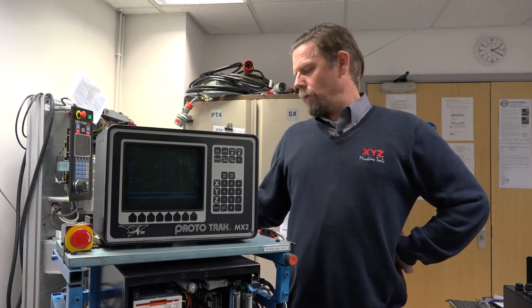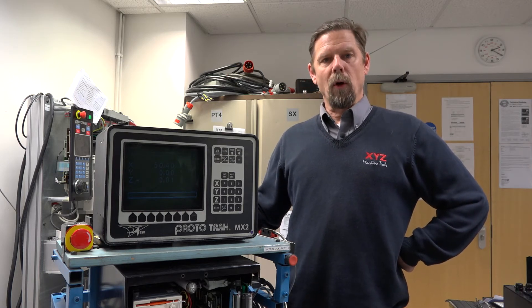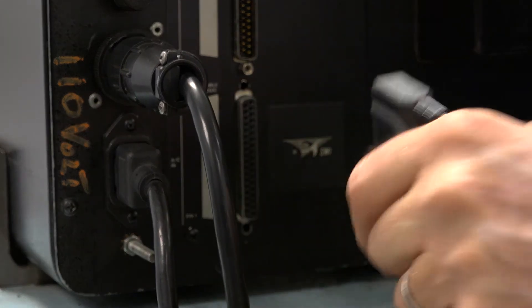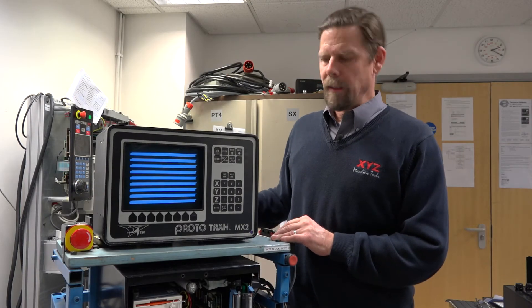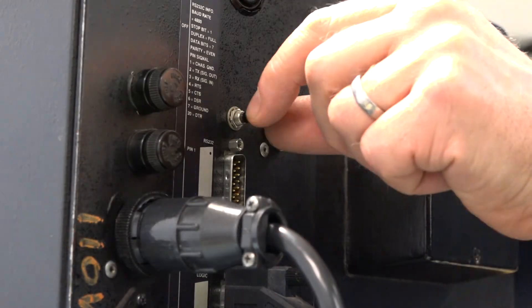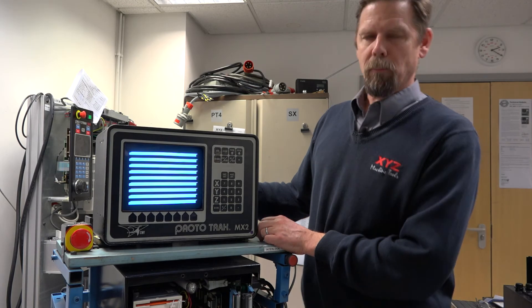Removing the logic cable, which is located on the back of the monitor, we should under normal circumstances get nine horizontal bars across the screen. With the cable disconnected the nine bars show up evenly spaced. With the brightness knob, also located on the back, you can increase or decrease the brightness to better the picture.